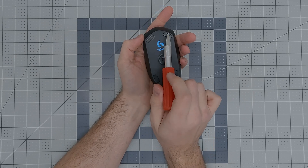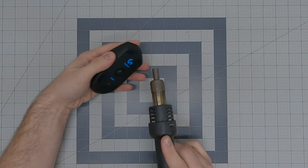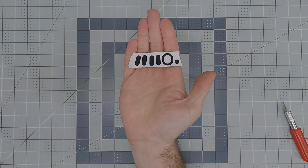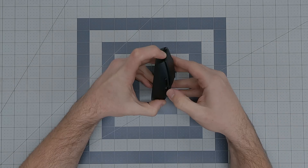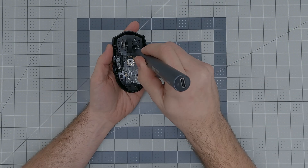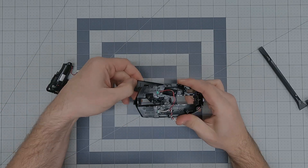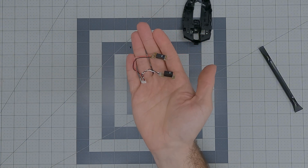As I didn't want to spend any more money on this project, I want to try and preserve the original skates by heating up the adhesive with a heat gun. Now to just remove every screw that I see, and I'm going to be sure to save these screws because I'm going to be using them in the 3D printed enclosure. The 305 uses a pretty unique mouse button setup, which has the left and right click switches mounted on the shell rather than soldered directly to the board. I'll have to get creative later on when designing the new shell.